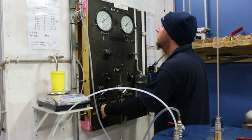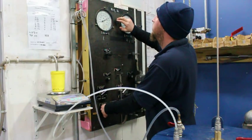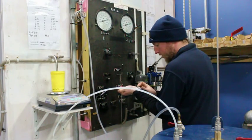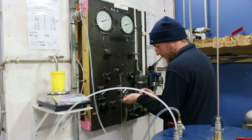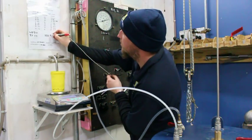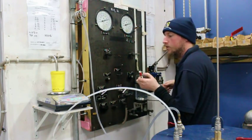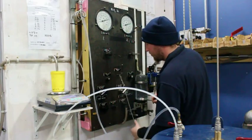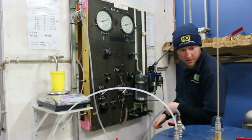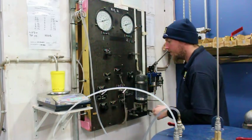Just making sure we've got no leaks. And there we are — so now we'll just wait our 30 seconds. We've hit 13.5 cc's. I know this cylinder's got a maximum of 15, so it's passed. While we're waiting, we'll just check to make sure we're not leaking and that we're holding our test pressure. And that's our time done.